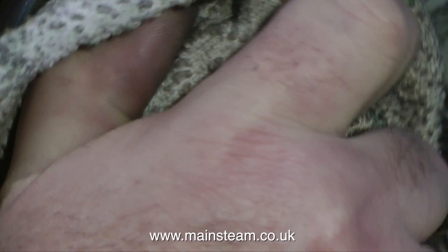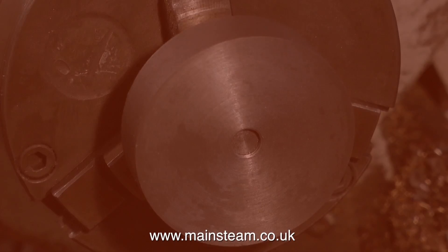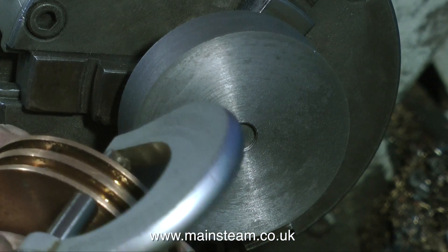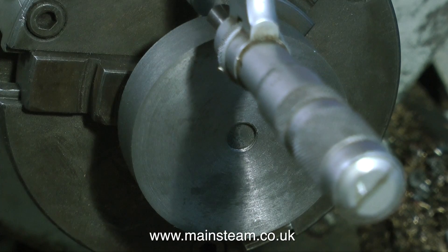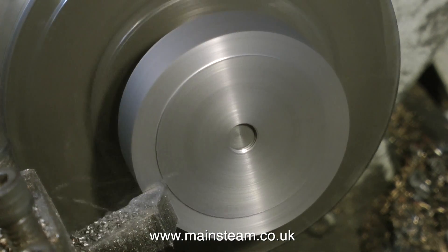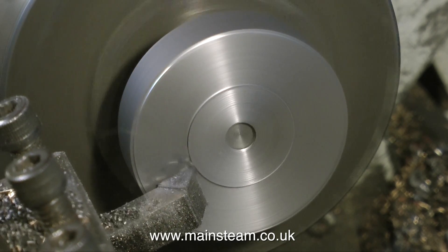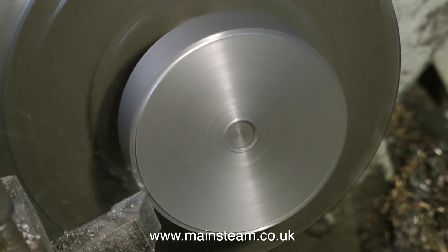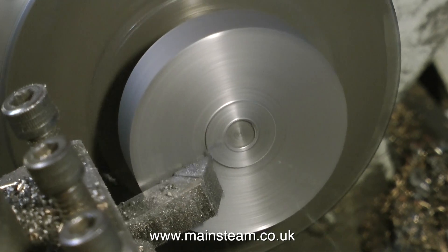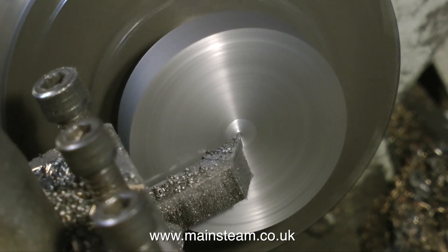The edges of this piston are very sharp — perfect right angles — so I'm using an old towel to grip the piston, and this way I can really tighten the piston blank onto the rod without the fear of cutting my hand and bleeding profusely all over the workshop. In this clip I'm checking the original size of the piston with the micrometer, because I need to accurately finish the blank to be exactly the same thickness. I now need to take several light facing cuts across the front of the piston blank. Always remember that when the piston rod is in the chuck this way it's only supported by the piston rod itself, so go easy.